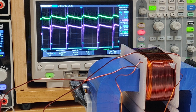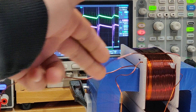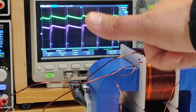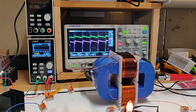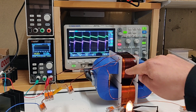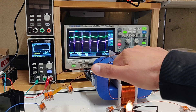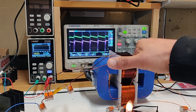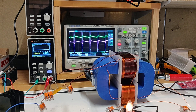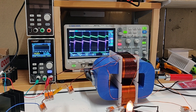Basically all I've done is I bumped up the frequency a little bit — we're at 7 kHz right now. I switched around the input, so now the positive is going in this side of the coil, which wraps around over the top. Magnetic field going that way. The diode is still set on POC1 so that any induced voltage or current would create a magnetic field this way and would stop the other direction. So essentially the input coil would now be opposing POC2, not POC1.